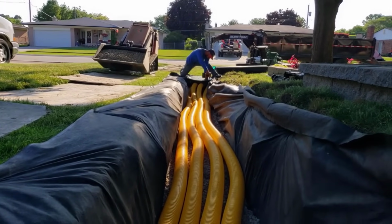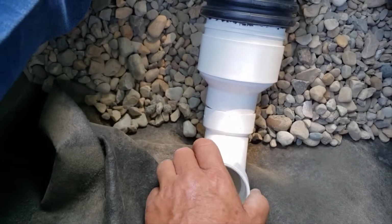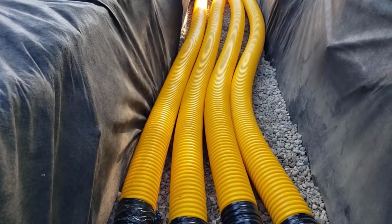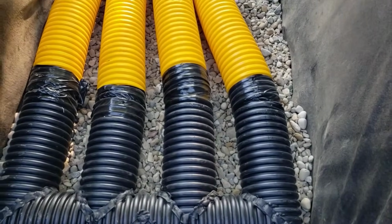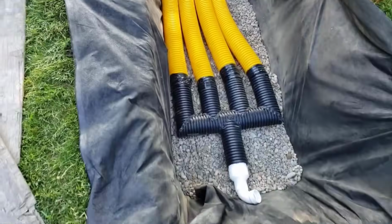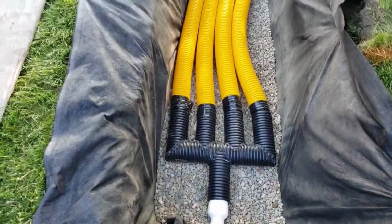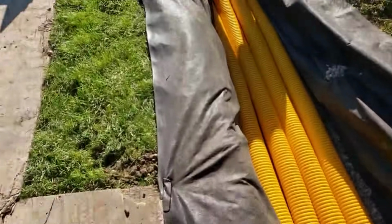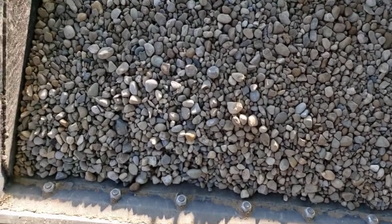So there, we got a 20-inch round basin at the end. We got the two center pipes tied to that. That's only in the event that we get a 100-year storm, and the 100-year comes, and we get 6 inches of rain in X many hours. At least this has an outlet. Very rarely will a customer see water coming out of that 20-inch basin. Very rarely. And we're 6 feet off the sidewalk to make Sterling Heights happy.